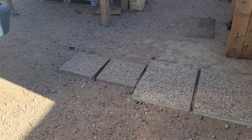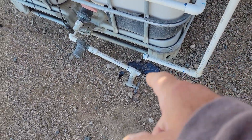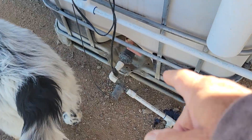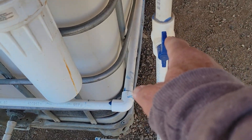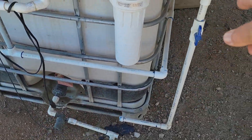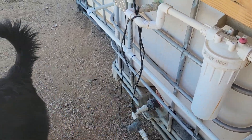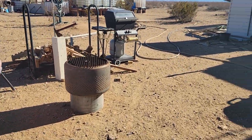You have to remember that. If I shut those two valves off, that pipe will freeze tonight when it gets below 32 and it'll be broken in the morning. Insulation is okay as long as you don't get a deep freeze down into the 20s, because that's still going to cause a problem. On my tote I've got a broken pipe — this happened a month ago because I had the valve shut off on both ends with nowhere for the water to expand, and it blew the pipe apart.